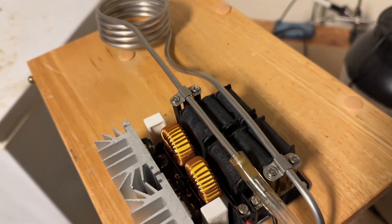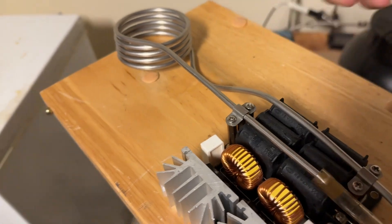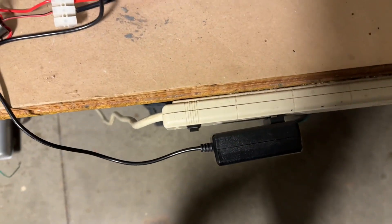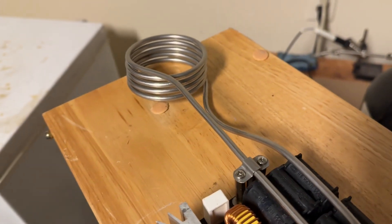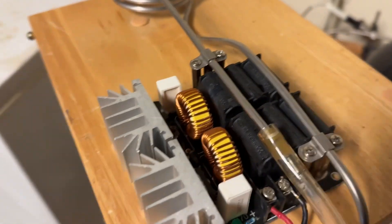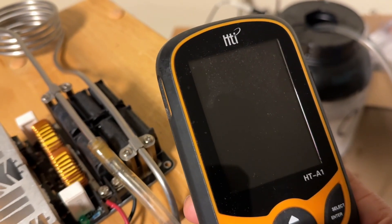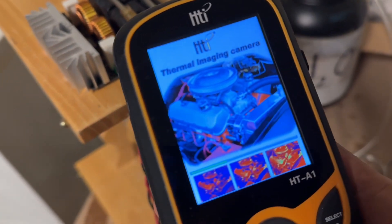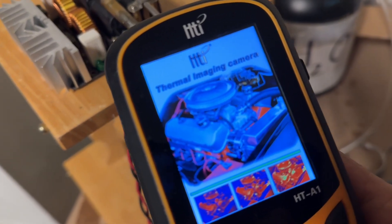The amount of heating you get is going to depend on the rate of water traveling through the coil — the slower the water travels, the more heating you get. I believe this pump is a little rapid, so it may pump too fast and the water may not heat that much. Since I've never tried this I have no idea, so I'm going to use a thermal meter to measure the temperature of the water after collection, and then try a different setting with a slower flow rate by adjusting the voltage applied to the pump.